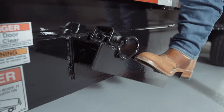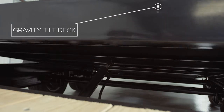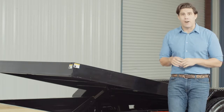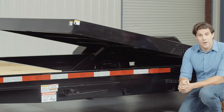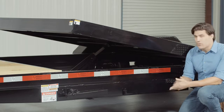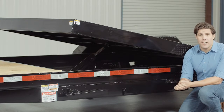As we mentioned before, the 17 feet of bed uses gravity to tilt for easy loading and unloading of your equipment. Included in the hydraulic system there is a valve that allows you to lock up the tilt bed in the up or down position. Locking the valve while the bed is in the up position ensures that the bed will not go down while loading. The system gives you total control of the tilt bed's position and increases the safety of the operator.